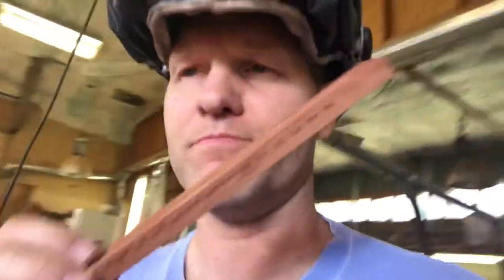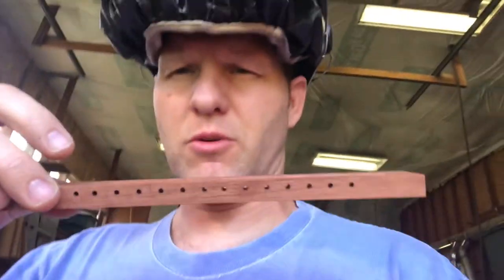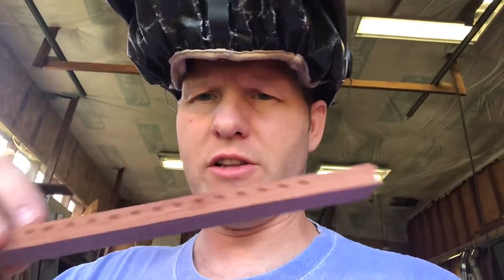The tie block is all done with a nice little buff job. Next I'll wander around the shop to find the bridge blank — there it is. I'll be working on this bridge blank for the same guitar. Normally I first do the radius on the underneath side and double-check it fits nicely to the top, then scallop the ends and finish sand it.